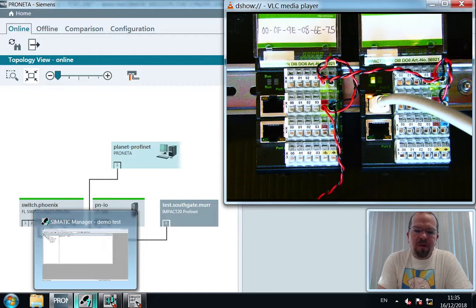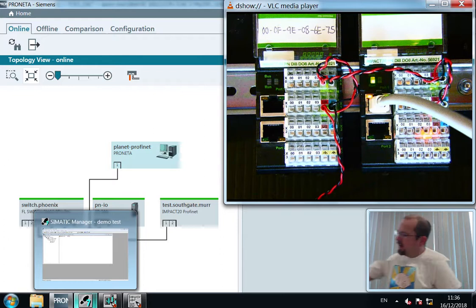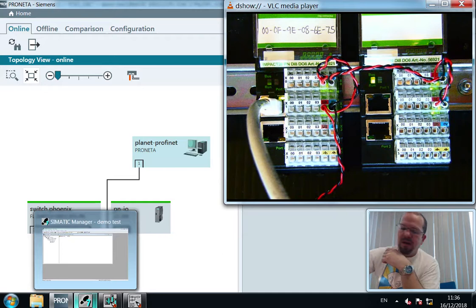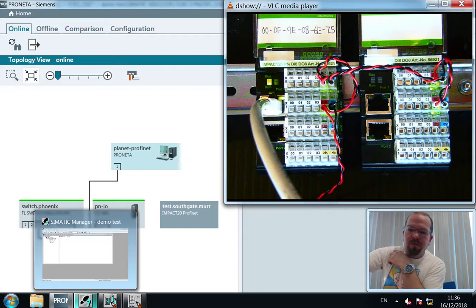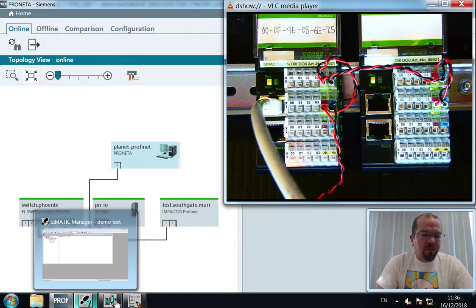Then I'm going to expect PLC to catch up and start turning on the lights. Okay, so flicking the switch off. There, turn, disables the functionality, turning it on, does. So I swap back. Now I'm currently using the PLC switch to go from stop and run mode. Now, that's an indication that my OB85 and 86 are not set up properly. They're to do with local and remote disconnection.